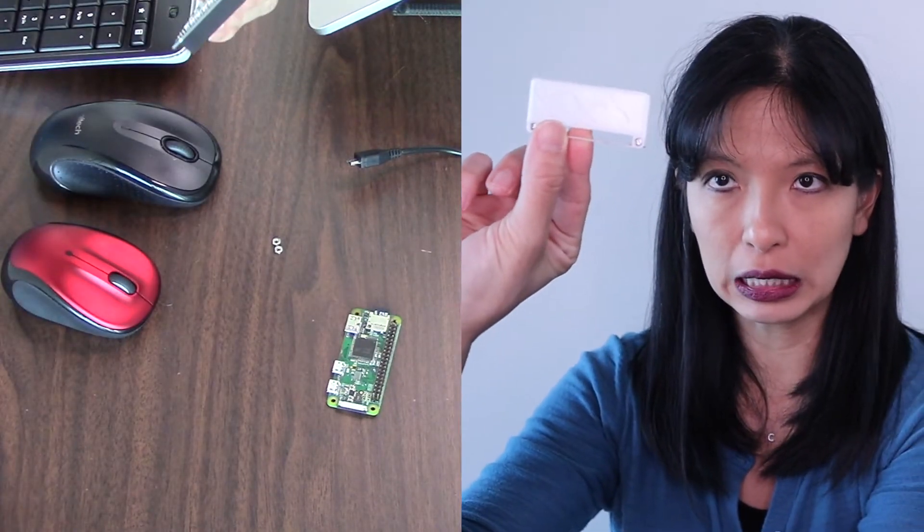I've gone the extra step and added a diffuser. You could buy a diffuser, or I just 3D printed one — I've left a link to the STL file on Thingiverse in the description. This is clear PETG filament; you could use clear PLA filament as well. I've got two 2.5mm screws and two nuts to line up with the unicorn hat, creating a nice little diffuser for this project. Then I'll pop in my micro SD card and we're going to SSH into our Raspberry Pi with Raspbian Lite — all I need to do is power up my Pi.